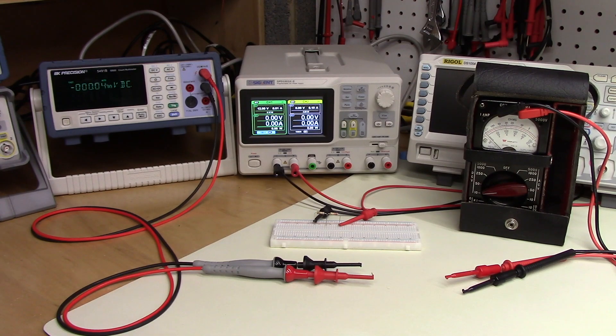The current is limited by the resistance of the voltmeter circuit, or in more complicated terms, the DC input impedance of the instrument. The sensitivity of such an instrument is generally quoted in terms of ohms per volt, and the effective impedance of the voltmeter is simply the maximum value of a particular DC scale multiplied by the sensitivity.